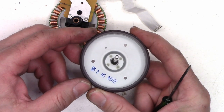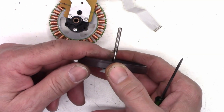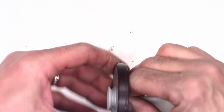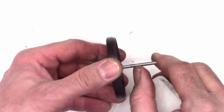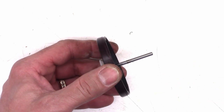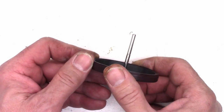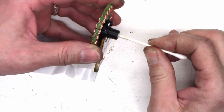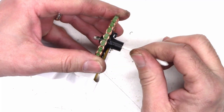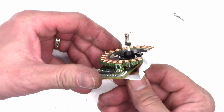Maybe it just needs a really good cleaning — hard to tell. We'll get some acetone and a cotton swab and try to clean off whatever that is. Actually it looks scored. So, just a paper towel with some acetone. It is scored up a little bit. Let's go ahead and clean out the bushing and see if that makes any difference. I have a cotton swab moistened with acetone and I've removed a lot of the cotton from it. Look at what came out from the inside of it — it's filthy inside there.